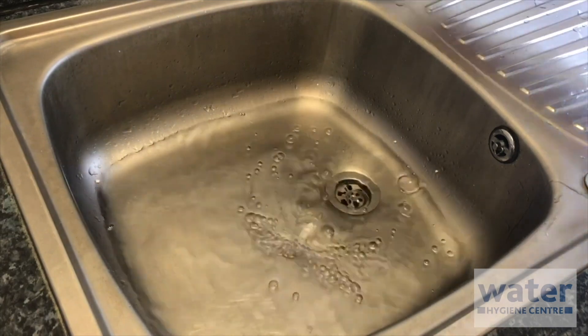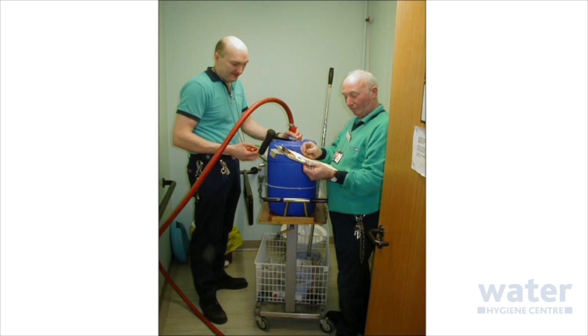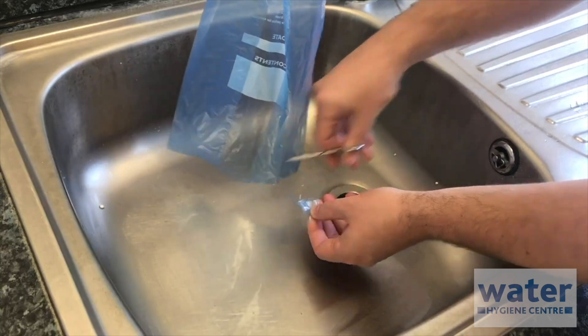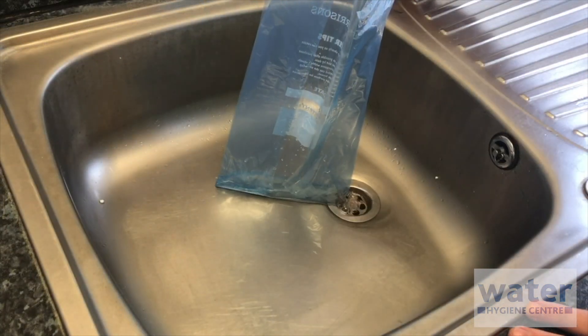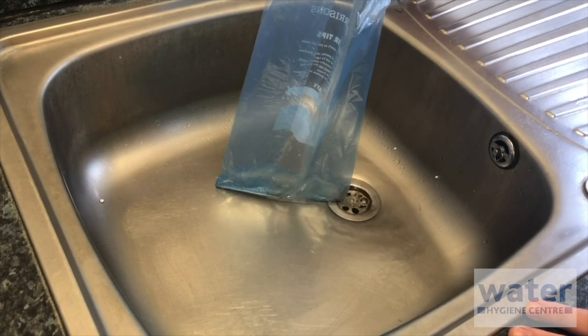There are a number of easy ways you can achieve this. A really easy and simple method is to use a towel wrapped around the tap, with that towel going straight into the drain to catch any splashing. If the towel option is used to minimise aerosolisation, this towel should not be used on another outlet — this is to prevent cross-contamination between outlets. Here you can see a hose has been attached to the tap; the end of that hose has been submerged into a sealed canister to prevent aerosolised water. You could also use a plastic bag around the end of the tap, but as you can see in this video it doesn't quite eliminate all of the aerosolisation. Here you could simply use a towel over the bag and over the plug hole to catch any aerosols.